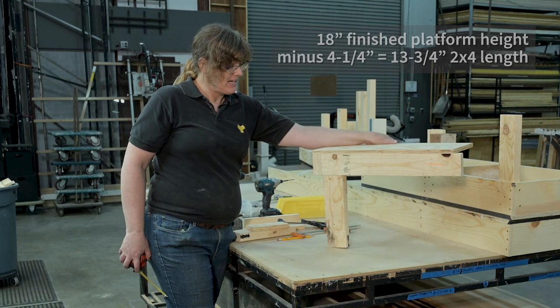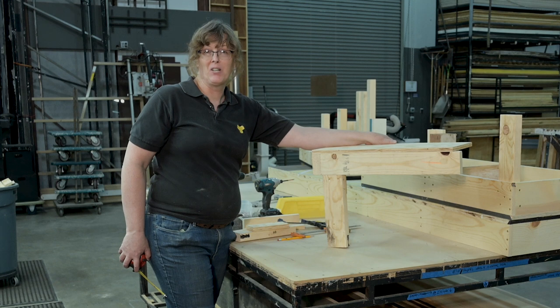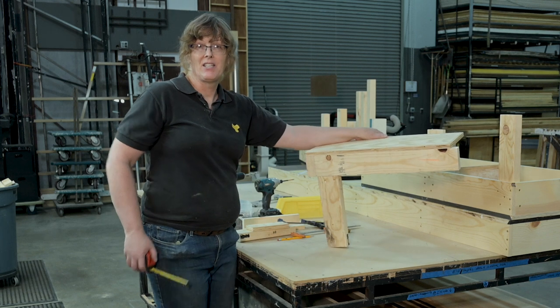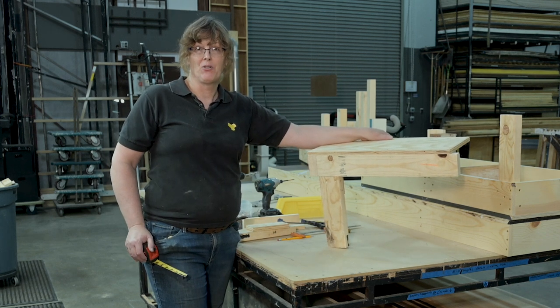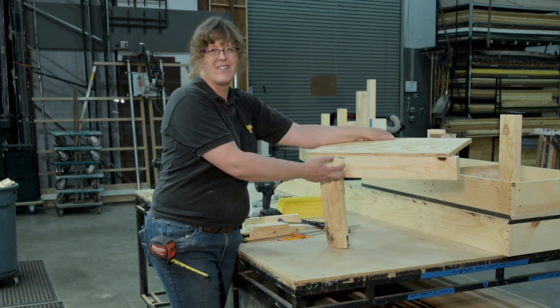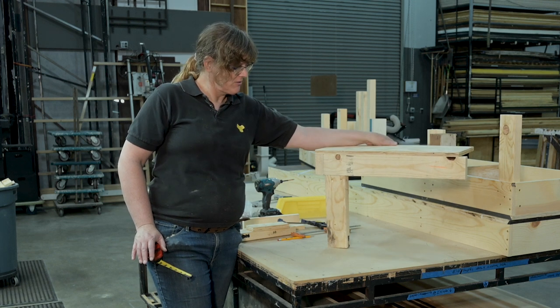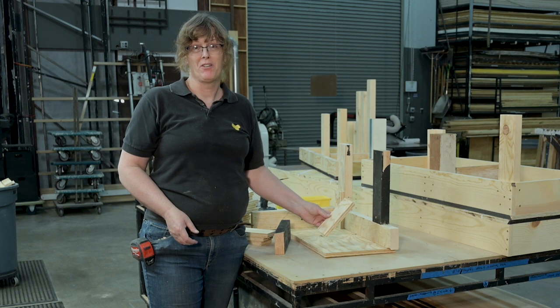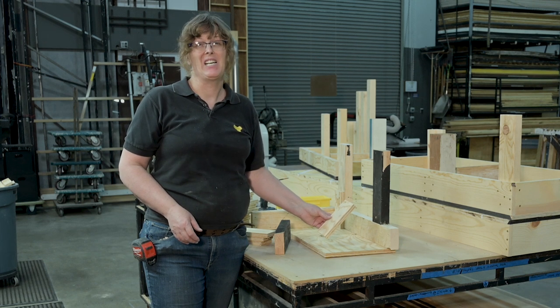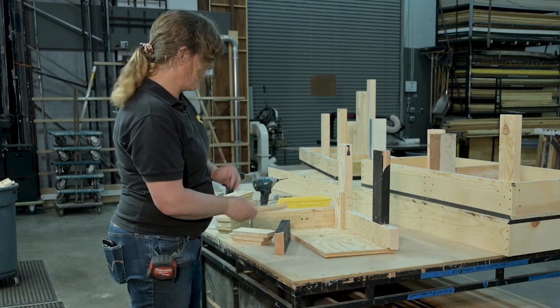So that is another legging option for you. I don't really care for it because it's a lot of extra work — a lot more pieces, a little more complicated to teach and understand — and there are some flaws if I don't cross brace, if I don't use enough screws on the inside, if I'm not really secure with my joints. It requires 2x4 platforms, which I don't always have. But it's one you can consider, and it is a great way to use up all your little scraps of plywood — you always have lots of weird scraps of leftover three-quarter inch plywood that you never know what to do with.